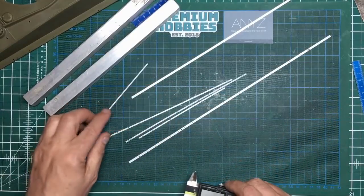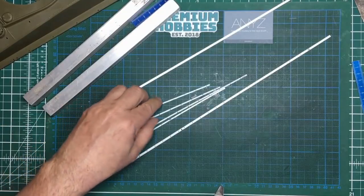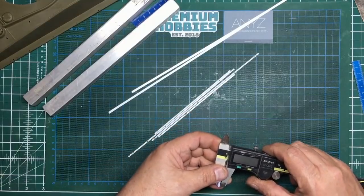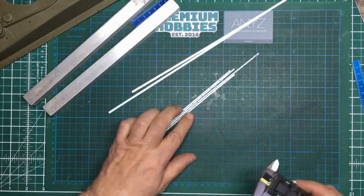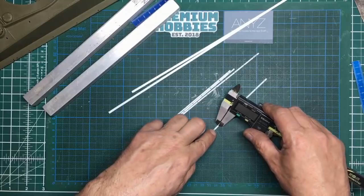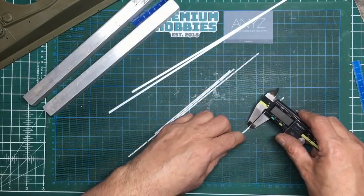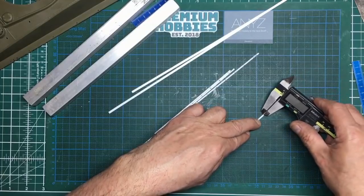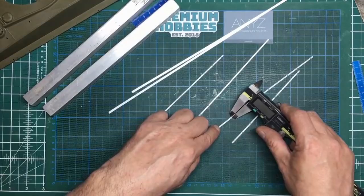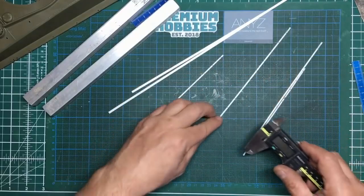I've cut these from strip because I didn't have any 2mm wide strip — I'm running low on plastic strip supplies, so I'll have to get some ordered. Set the caliper at 1.01mm, hold one end and go along. Watch it doesn't wander off. I'll come along and remark where it wandered. This is just so we can come along with a pin and mark the centers of our holes — you really want to be marking them rather than going straight with the drill.